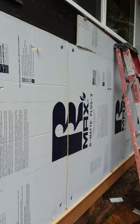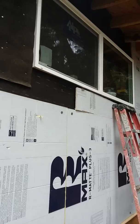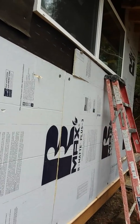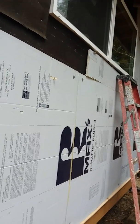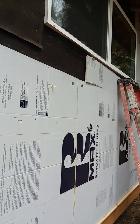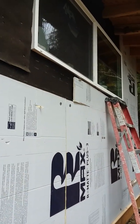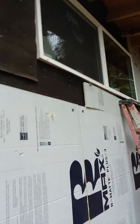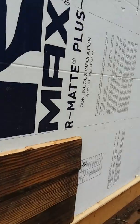I'm really excited about this because this is our south-facing wall, and when we turn this into a passive solar greenhouse it'll heat almost like a Trombe wall — it'll heat the well house, and then we can open the window to let the heat in from the greenhouse, then open the greenhouse and let it all air out through the clerestory up into the well house.